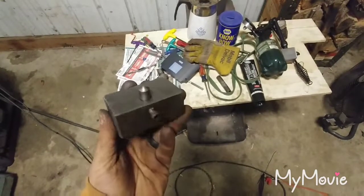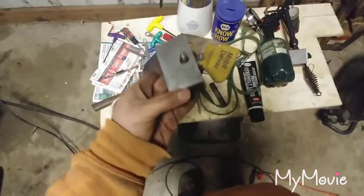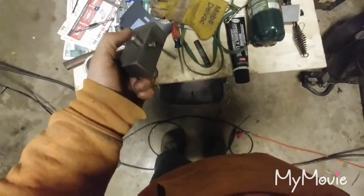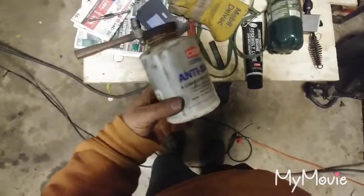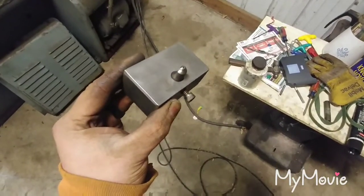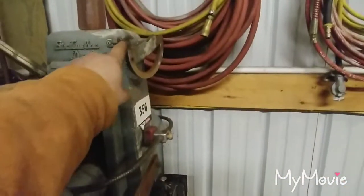Got it all together — that's the finished product. Nothing fancy, but it'll do exactly what I need. What I needed was the weight and mass for the magnetic chuck to hold this diamond. One thing I wanted to add: any time you can, use anti-seize — especially if you're running any sort of coolant, this would rust itself in there so tight you'd never get it out to replace the diamond. Got it all cleaned up and anti-seized up.